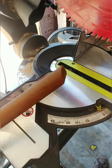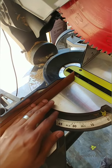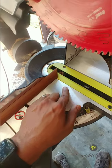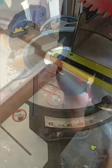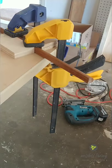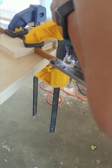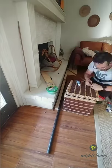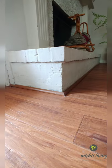For the quarter rounds I used my miter saw. Most miter saws can cut at 45 degrees — it's recommended to cut at 45 degrees especially at corners and also to join two quarter rounds together. For any special cuts or specific shapes I would use the jigsaw. After dry fitting, I put construction glue on the bottom and the back side that touches the bricks, and here's the finished product.